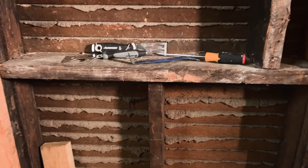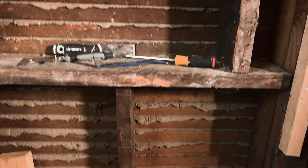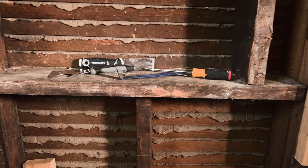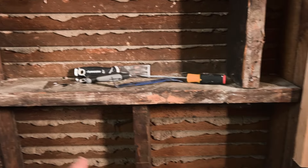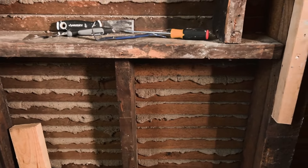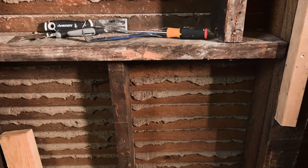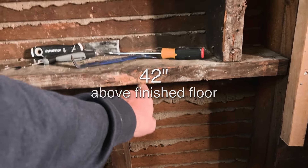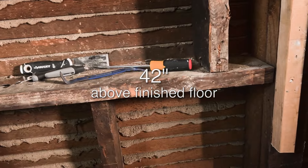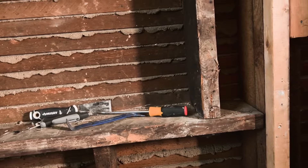I'd hoped to put the toilet over there, but that would have had some drain considerations and would have been a big problem. So I'm going to put the sink drain here and do a 45-degree vent connection, which counts to code as a vertical run. That means I don't have to worry about coming up to 42 or 47 inches before the horizontal run, which would put me right up against this board — a diagonal run bypasses a lot of those issues.